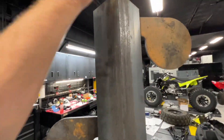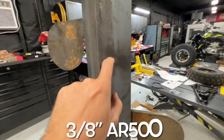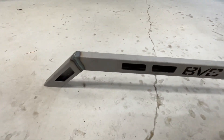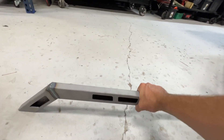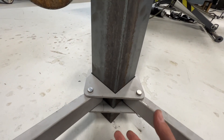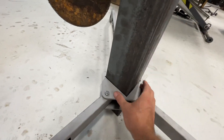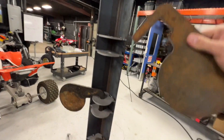All right guys, bear with me here. So we got some 4x4 angle — this stuff is quarter-inch thick. We've got the AR500 paddles right here and I'm excited to see how this does. My biggest concern with this whole setup: I wanted to use my CNC tube cutter to make the legs — I wanted them to actually be tube and hollow. They're extremely strong like this. We've got some pins right here with some clips — no tools required to assemble this. Basically these go together, they pinch on the legs. This leg is butted up here, that one's butted up there. Kind of keeps it in that orientation. This slips down in. And the paddles — if you want to just take them off real fast, that's not hard.